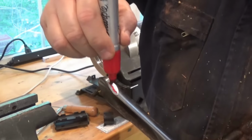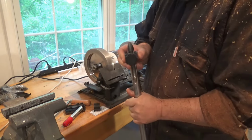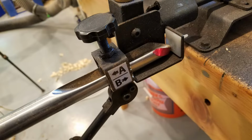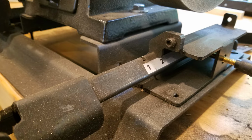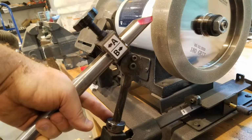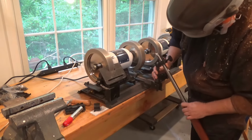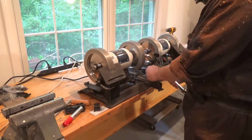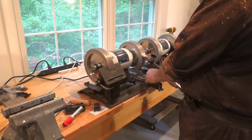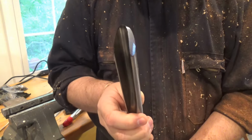I have been cutting for a while now, and the bark tends to wear the sharp edge faster, so let's give it a touch up on the grinder. I measure 2 1/4 inches, make sure the guillotine is in notch number 2 and the swivel head is forward to position B. I begin from one wing and sharpen towards the center, and then I repeat from the other side. 16 seconds of sharpening and we are back to the lathe.